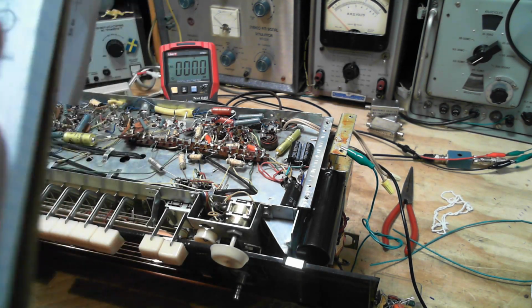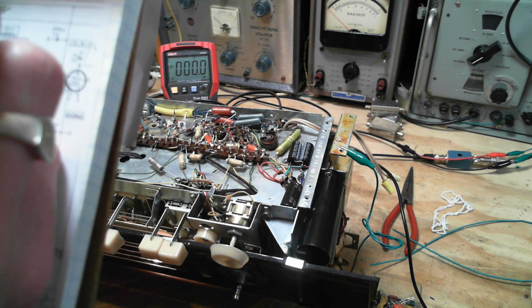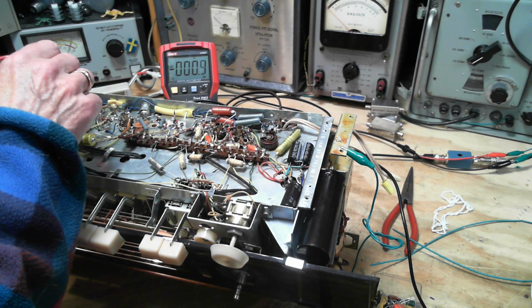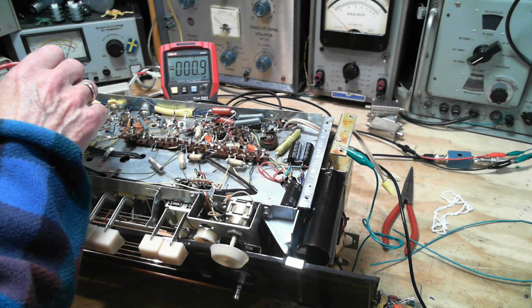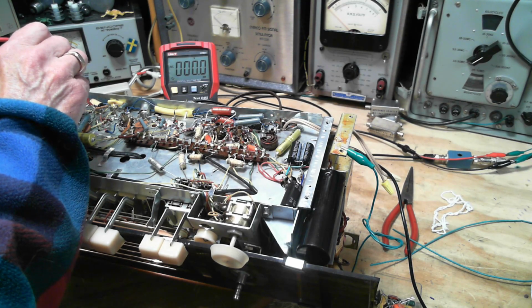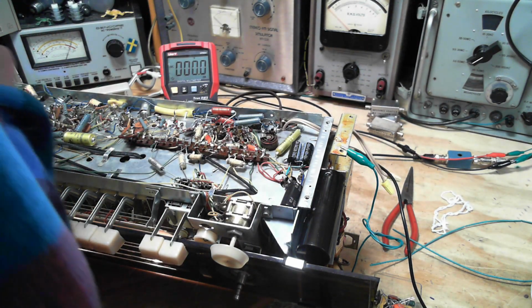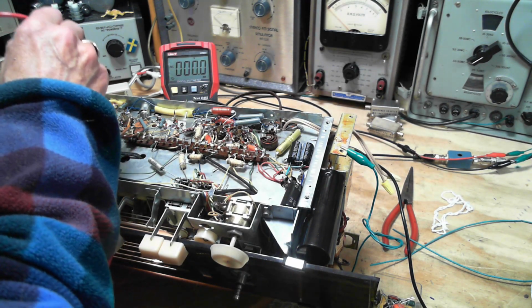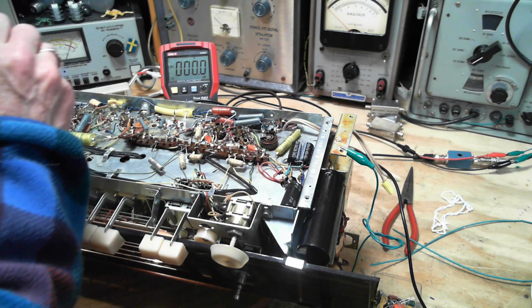And the number there, let me just double check with my magnifier, make sure I'm reading it right, 90 volts, pin 8. 90 volts, pin 8. I got zero. How did that happen? 90 volts, pin 8. I get a zero. Because it's not pin 8, because I made a mistake here. Maybe this is pin 8. Nothing there either. That's a ground, I'm pretty sure that's a ground connection. This is pin 9 here. 9, 8, 7, 6, 5, 4, 3, 2, and 1.